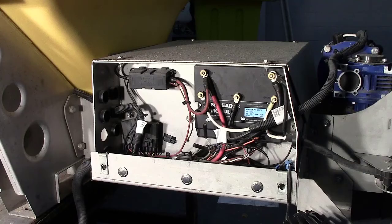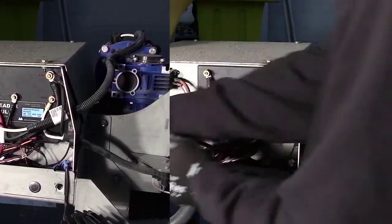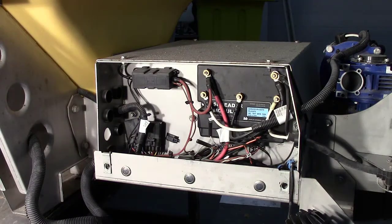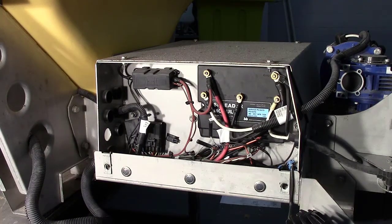This video will guide you on how to maintain a module that is on a FleetFlex electrical system. Before servicing the module, be sure to unplug the spreader from the vehicle. There is some residual voltage left in the harness even with the vehicle turned off. This small voltage can cause a power surge in the module while working on the components in the electrical box.